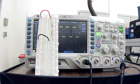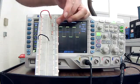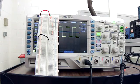Well, let's call it 6 volts DC. Why would I call it 6 volts DC? Because the resistors are all the same. So the voltage here would be 2 volts. On the second resistor, 2 volts. On the third resistor, 2 volts.